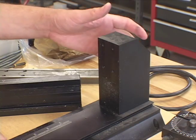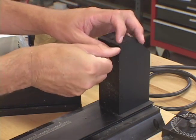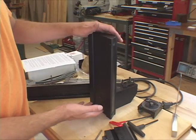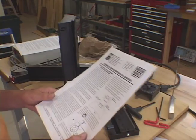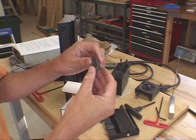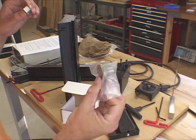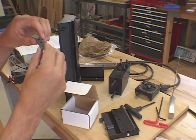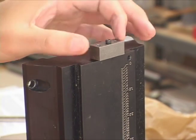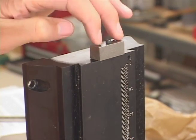I think it's time to put our screws back first. I'm going to take these allen screws off here and take this off because I want to be able to clamp the base. Our instructions tell us we've got to bolt the template block — the little rectangular block, this little guy with three little holes on it — to our base or table. We also use this other cylindrical shaped template that will be used for the z-axis column. Now that we've bolted this little template block to the base, we want to make sure this surface is parallel with the base surface where the screws will be nice and true.